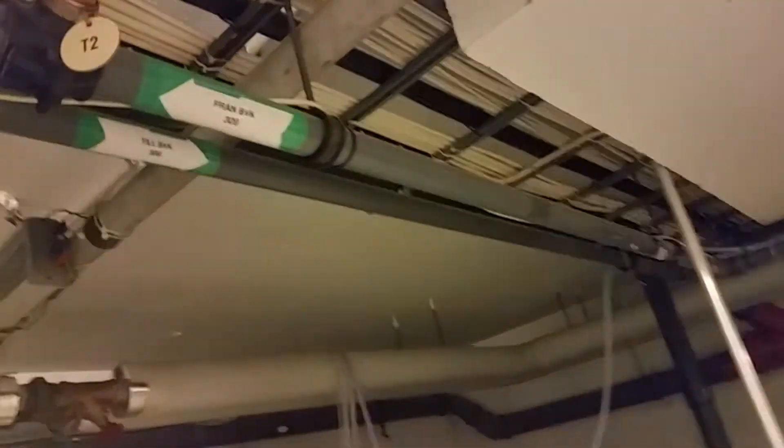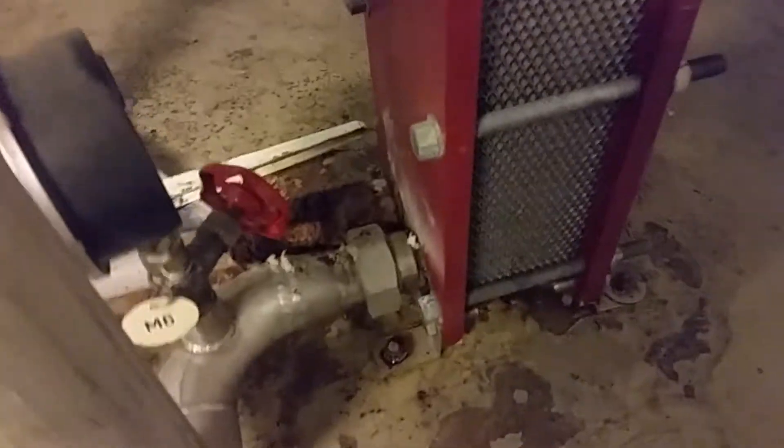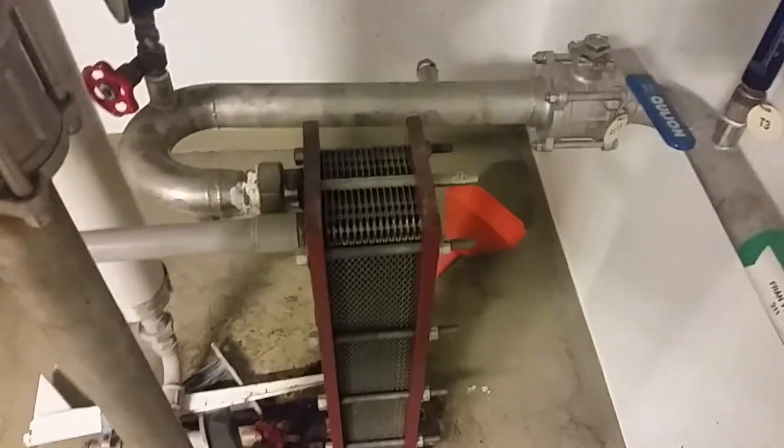There's a pipe that goes to the BVK. Let's have a look at the heat exchanger — they are going to change that because we got a little problem. Look at that: it's rusted, that's very bad. It's from the district heating — that's the district heating tube and that's the bath water, those two lines. We got a problem here and it's dripping bath water on that. It's corroded and that's very bad — there's chlorine and everything in that water. It was because of that this seal wasn't good enough. So this is a very special heat exchanger that can handle this pool water and bath water.